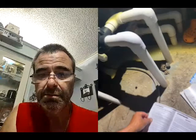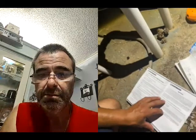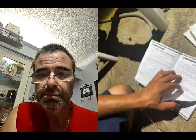Yeah. Let me see if I can see the Hayward. I'm reading the manual. I got the manual in my hands to see what it says about the operation. It should be in the front or back. It should tell you what the rating is on amperage at 240. Let's see, if it's like 28 amps, you can go with a 30. Yeah. Okay.